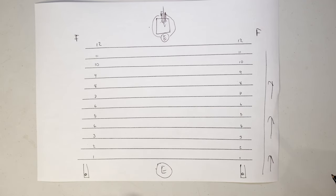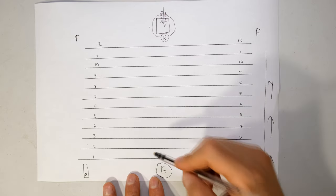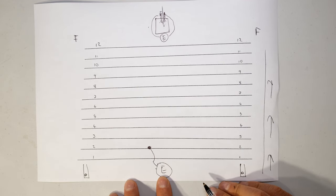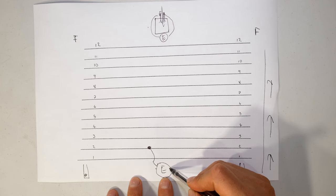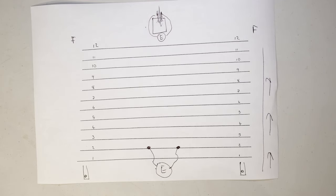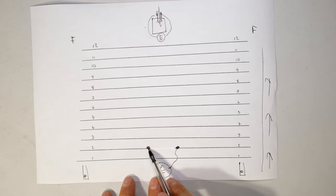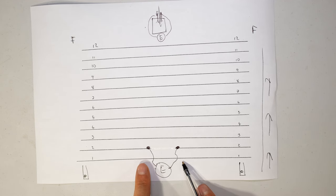The energizer needs to have a sending wire. Let's say you're going to use the first line as earth. So you're going to go over that line and into that line, meaning your one live wire of your energizer is sitting on line 2. You'll then need to connect the return wire of your energizer also to number 2. But you're seeing there's a short circuit here, so you need to actually open that - that is now an open circuit. So your fence starts on line 2 and it ends on line 2.